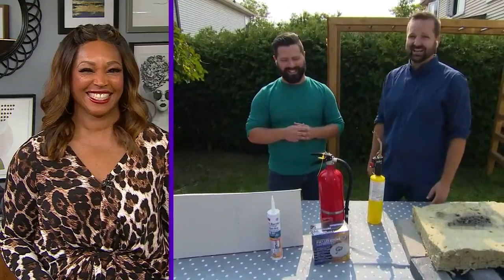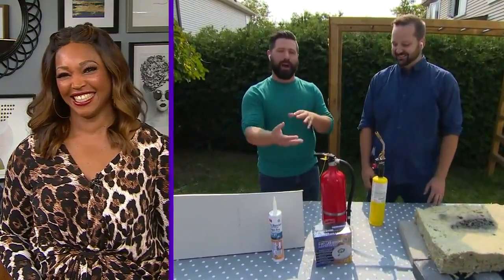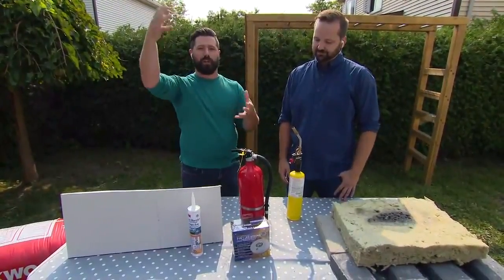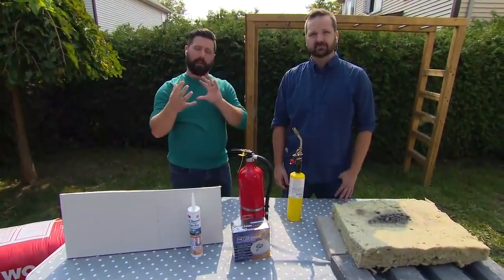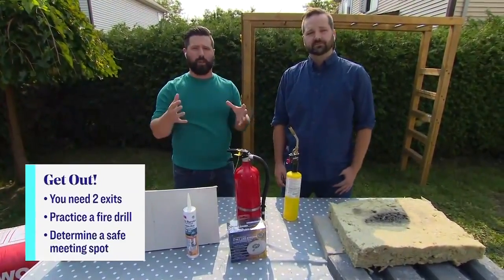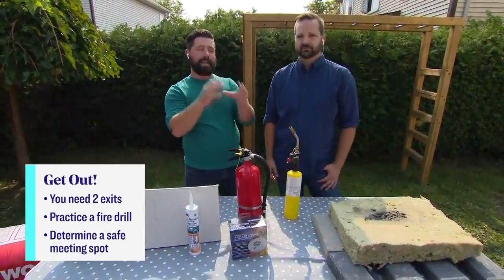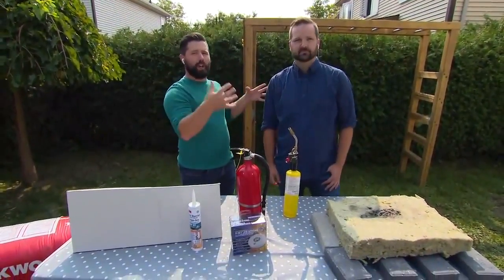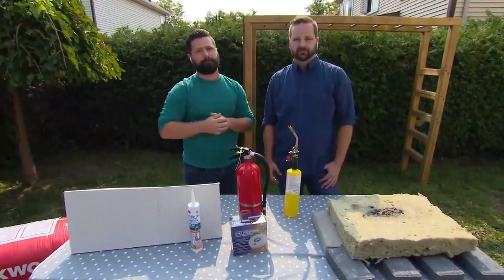That's a fact. And like Dave mentioned, they are wired. So you have these on both units, so if you have smoke on one unit, it'll alarm the other unit as well, which is key. The other big important factor is means of egress. So that's having 2 points of escape from a unit. This is particularly important in a basement apartment to make sure you have the door to get out and you have another window that's made large enough that a body can fit out of it.